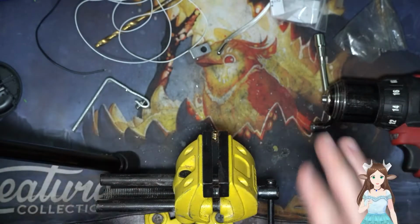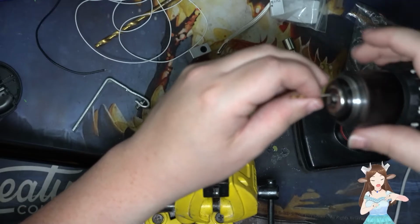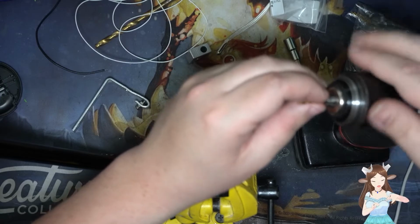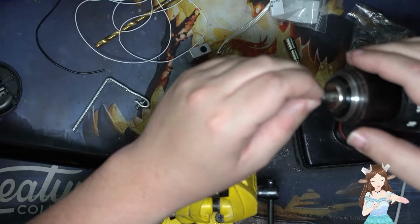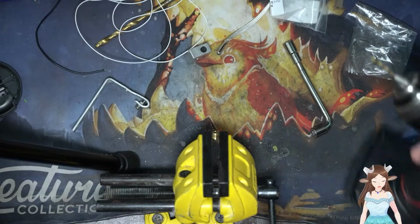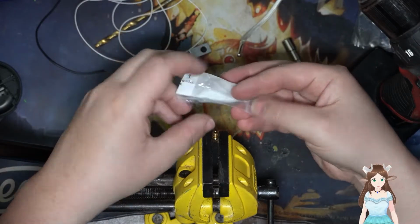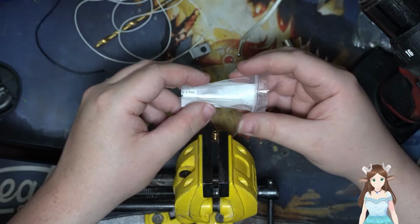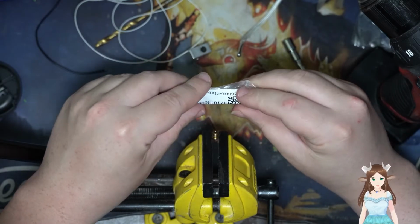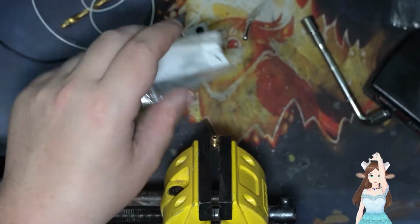Okay, so in this project we want to try and make 3D filament. 3D filament is usually 1.75 millimeters, and I know it's 1.6, but after thermal expansion, because what we're doing is we're going to cut up bottles, and they're going to be thin, flat pieces. And when you curl things up, they tend to want to just go back to the way they were. So you use that to your advantage. So when it unwraps itself, in theory, the 1.6 should take into consideration the 0.15 millimeter expansion rate.